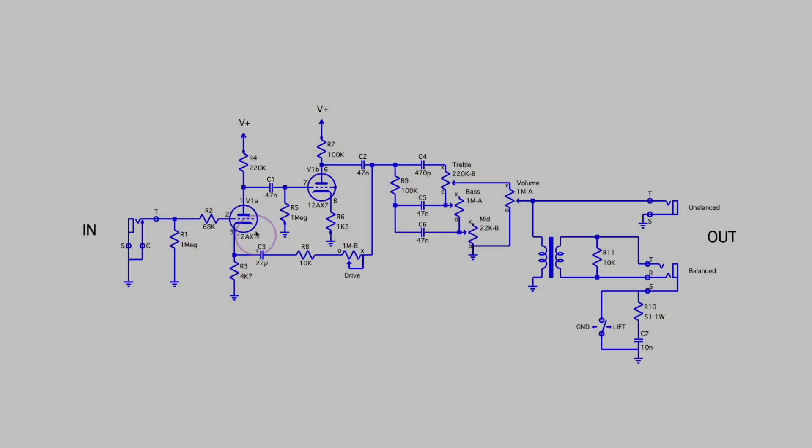A new subscriber of mine, Andy Dragas, noticed in the last video — the first video for this preamp build — that as I was going through it, I kept calling the tube triodes V1 and V2. I'm using a 12AX7; any 12AX tube can work in this preamp, and that's a dual triode tube. So it's more proper to call it V1A and V1B. I drew the circuit, the layout diagram, did that whole video and didn't even think it through. I've corrected the schematic and it now has the proper terminology V1A and V1B.